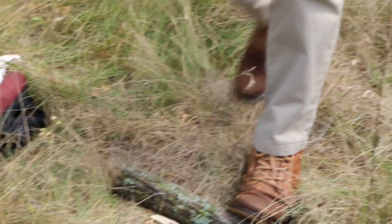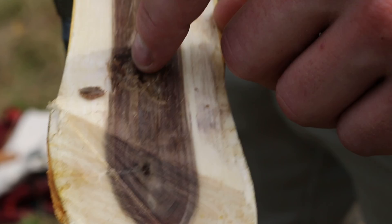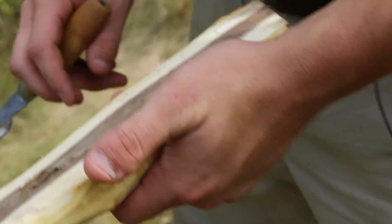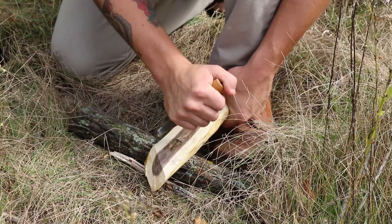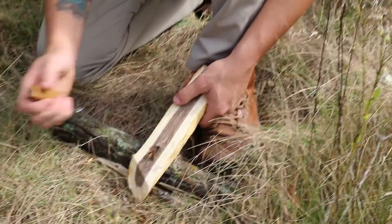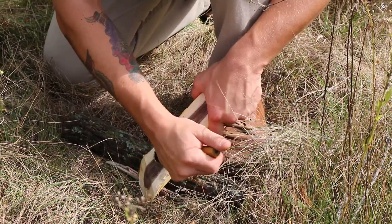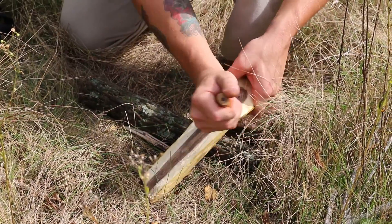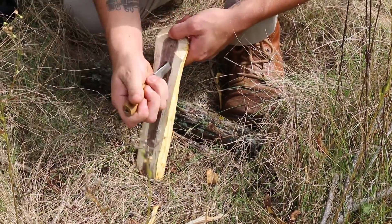Immediately I'm seeing some bug trails on this wood, right along here. My best guess is that that would run right through the heartwood, which is not good, but I think we can maybe try to work around it. I'm holding my hook knife like this and applying pressure with my whole arm — taking cuts from the left side and then moving them over, taking cuts from the right side, until I get a big enough bowl. That's really going to be my cutting method, just kind of back and forth. Then I'll start being able to round around my bowl as my cut gets a bit wider.